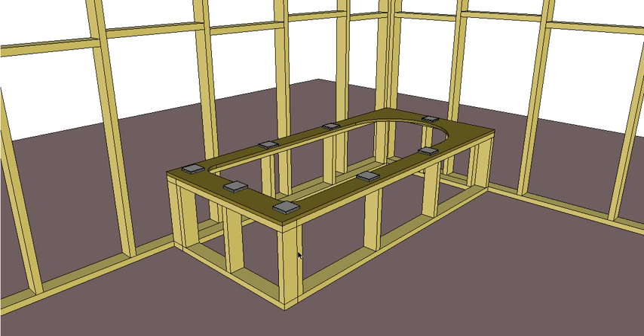Now that's the big thing to remember with the height of this wall — it's preferable to make that height work with tiles. The last thing you want is to be cutting small tiles along the floor or up under the bath. So you have to take into account the thickness of the floor tiles and the actual size of the tiles you're going to put on the wall to determine the height of this bath wall.